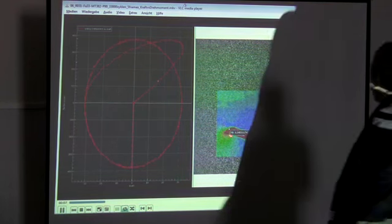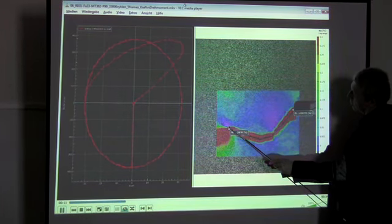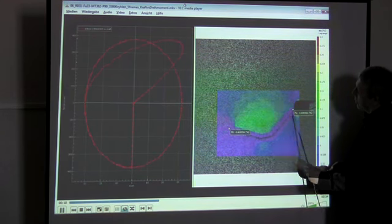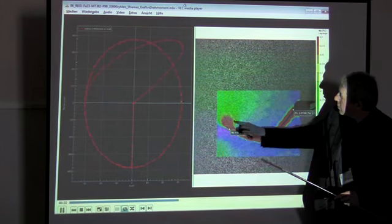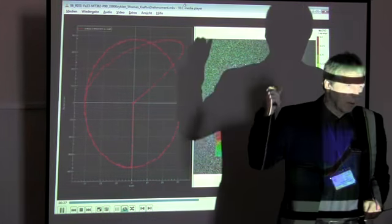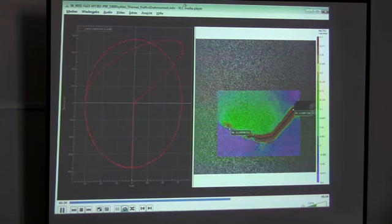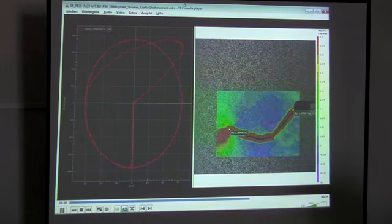So the crack tip is now here. So there is some curvature occurring, crack tip is here, and now you see again these epsilon yy strains. It's closed now, the crack opens from here, goes to that. You have a red point here, a red there, it shifts here. And this is an indication that now the crack tip is allowed to bifurcate. We have observed such occasions that at this position we have a bifurcation of the crack tip.